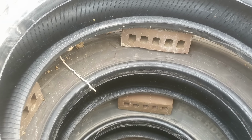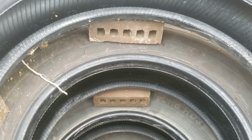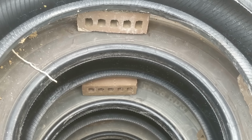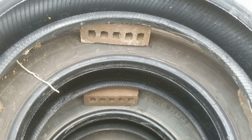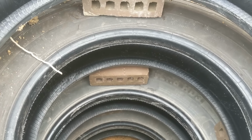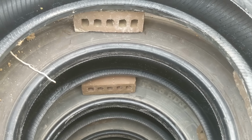What's going to happen with a septic tank and field line combo is that eventually, let's say 3 people live in the house, I would say that probably if you never cleaned it out, within 3 years, you would have to just cover it up with dirt and do another. But if you clean it out, it'll last for years and years. So you have it pumped out every now and then, or just simply take a bucket and dip away.